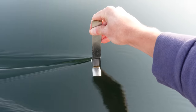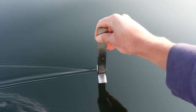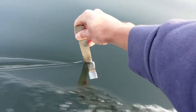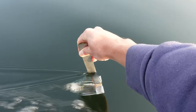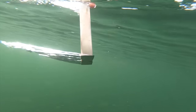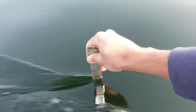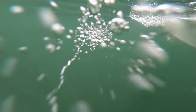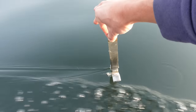By just holding this hydrofoil in the water, we can get a really good feel for how it behaves. There's very little drag at slow speeds — we're going like two meters per second. It makes a lot of lift when I increase the angle of attack, but it's really interesting how the lift just gets killed when there's ventilation like that. You can see how there's air pockets trapped under there around the foil — that just ruins all the lift. It has a lot of turning power when you change the yaw. Perfect example of ventilation: there's really hardly any drag at all; I can just hold it by the tip.